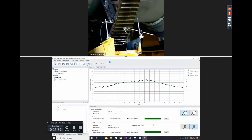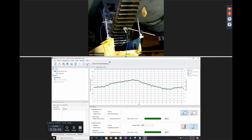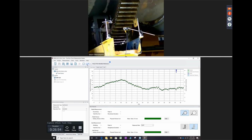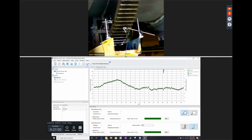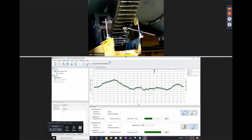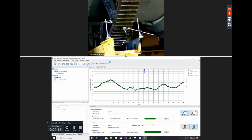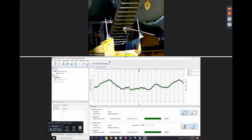And then it looks like the axial may be... so Ray's gonna adjust it to see if it's too close or too far. And this is something for the people watching to work with, because if it's too far away, you'll actually see it on the data set. If it's too close, you'll see it get hit by the gear itself. But right now, what you guys see is the axial movement, and then we can always adjust the radial movement, the green.